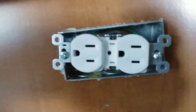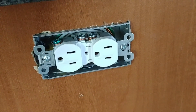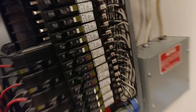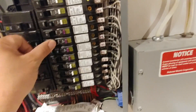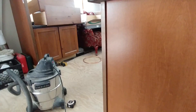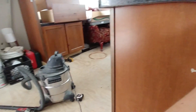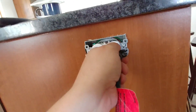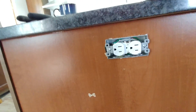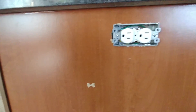And then we'll turn them on and make sure that everything's working. We've got it installed and all leveled up here now. We'll turn the power on — number 28 and 30. On, on. Nothing tripped, so that's a good sign. We've got the vacuum cleaner here, so hopefully if we plug it into either one of these it should turn on. That one works. And that one works. We're on two separate circuits, so we have successfully wired a split wired outlet.